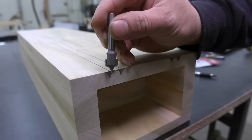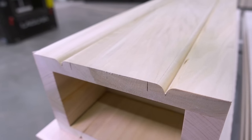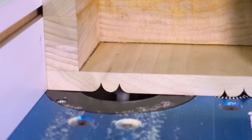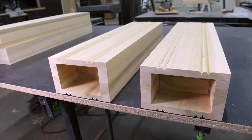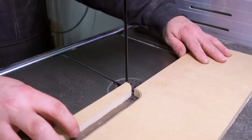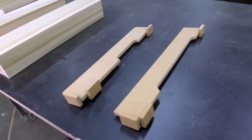While the columns are still simple blocks, it will be easiest to route the straight half-inch beads that run the length of the faces. I want a touch too deep on purpose to leave these ridges, which will act as a buffer during sanding. Now I can make some templates out of MDF to produce the cutaways. I can access the outside edges of the columns just fine to produce the outer cutaways, but the hollow arch in the center will be a lot easier if I just rip the whole thing in half, then route the channel.